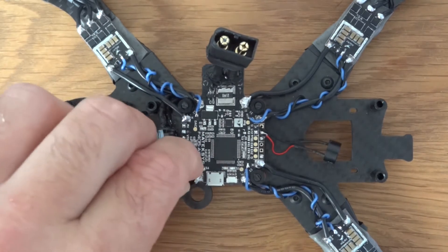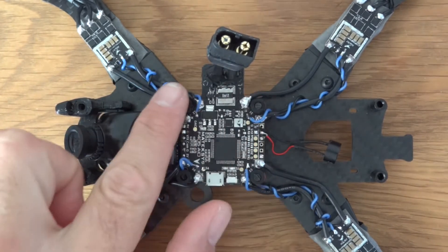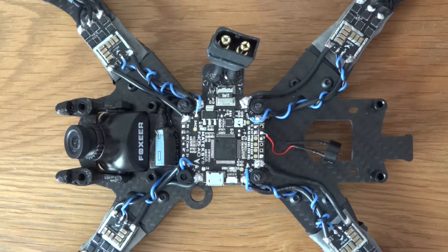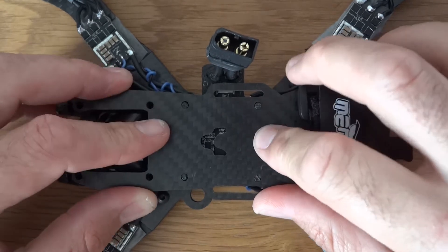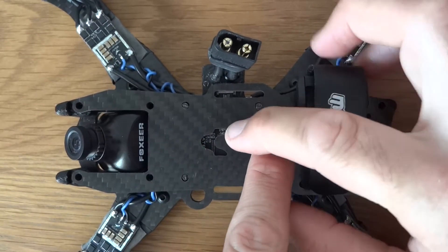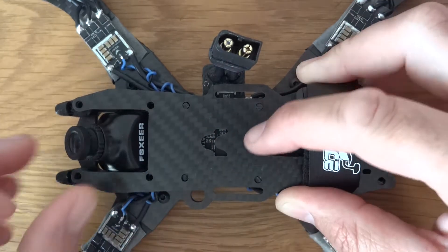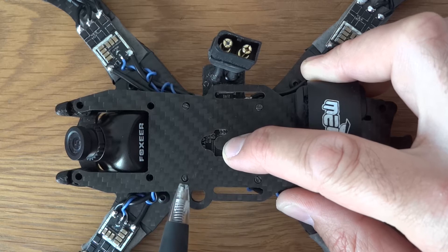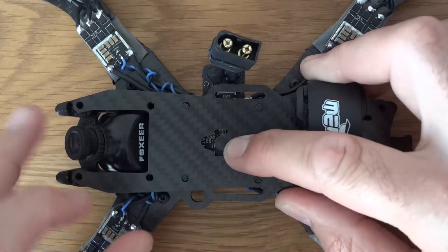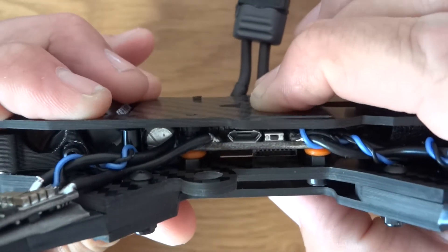Because of the stack space issue I can't really afford to add nylon nuts on top because it presses against the top of the board. However, as I mentioned in my original review, I've taken advantage of these four flight controller holes here. When the top plate is attached properly, the nylon screws — I've just cut them short — and they line up perfectly with these holes, which will keep the whole thing in place and hopefully give me the vibration damping I need.